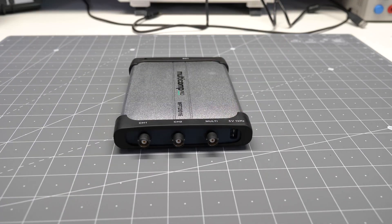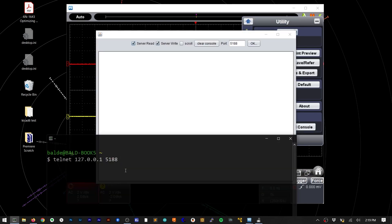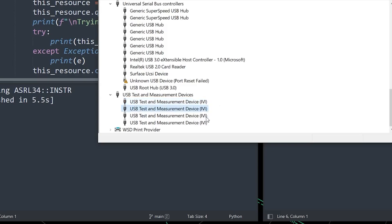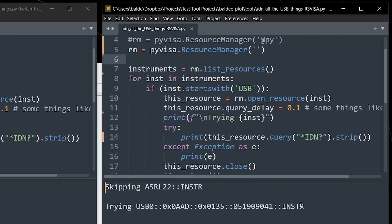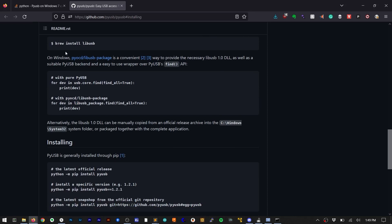Sometimes instruments stop responding, especially after you send them a whole bunch of bad commands — resetting the tool or physically cycling its connection might help. USB devices that require a PC to operate are not usually USB-TMC. For example, this oscilloscope's Windows software provides a SCPI interface over TCP IP, but not all USB-based instruments have this support. The Python VISA driver works great with USB devices on Linux — it's why I use the Pi 400. Windows is a different story. PyVisa with the Python driver cannot see the same four instruments, but when PyVisa uses the R&S VISA driver instead, it can see them fine. Using the tool Zadig, you can change the instrument's INF from USB-TMC to LibUSB, but then you also need a different version of LibUSB so that PyUSB can let PyVisa connect. I got this process to work once but couldn't repeat it for the video, so I recommend using Linux instead, even if you have to use a virtual machine.